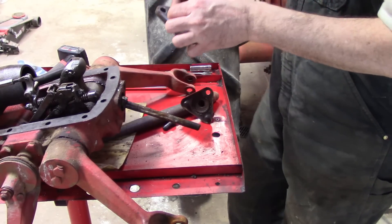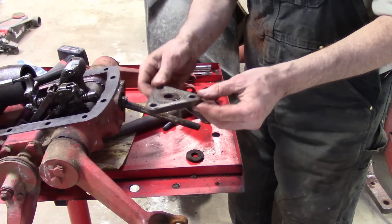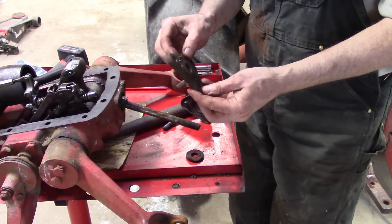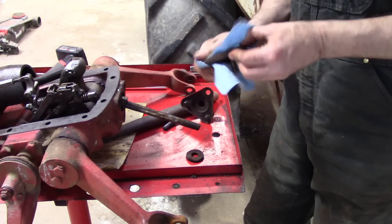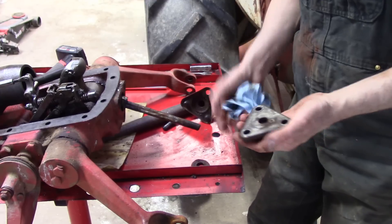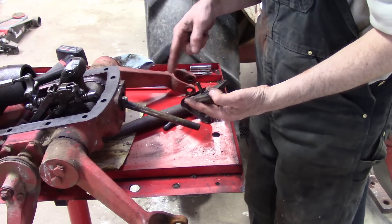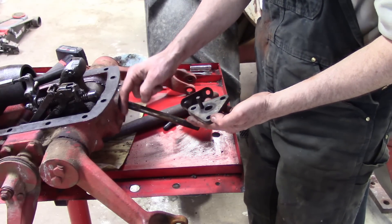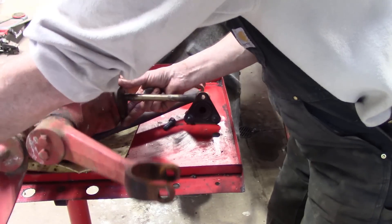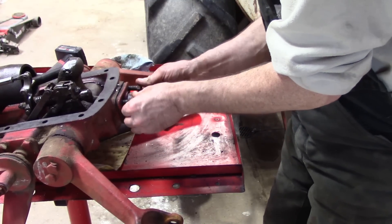Remove the bolts off the back. One thing it says is very important: check this plate for straightness. Mine does have a very slight bow to it, but not very bad. They say if this thing is dished too much, you won't get a proper adjustment. So once you get this apart, clean everything up. I bought a new felt ring to go in here. When I took this apart the first time, there was actually a layer of dirt between the surfaces — that's how loose all this stuff was. Install your piece, put the new felt ring on, and install the bracket.